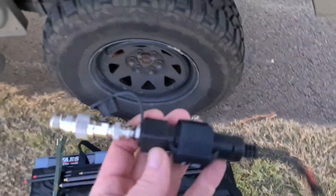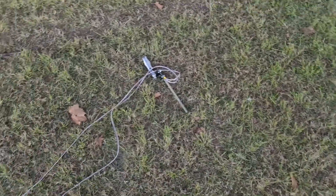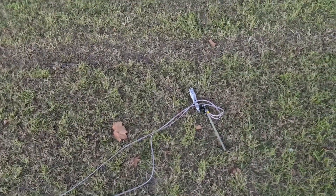I left the other bundle at home. We're going to bypass the Buddy Pole balun that comes with it and take the low band 80 metre coil and attach that directly on top of the heavy-duty spring to see how we go.